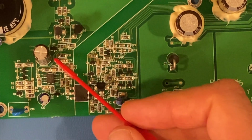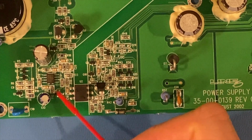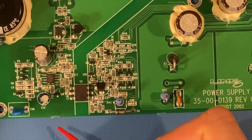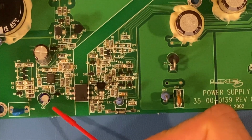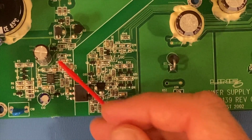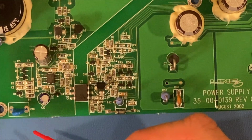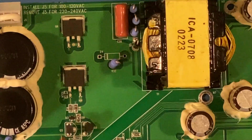And putting silicone next to small surface mount components, you're just asking for a lot of mess and trouble in trying to get the silicone out and service if you have to replace other small components. So they don't typically put it on very small ones like this, just the larger items that you see here.